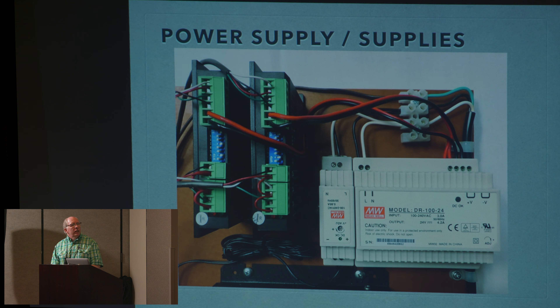At the AAW in Portland in June I did a talk on stepper motors, which motivated me to expand on that here and talk more about where they can be applied in ornamental turning. This is the apparatus — I've got it out on the table in there, you can see it or come ask questions. This is two of the industrial drivers to drive a slide rest and the spindle on that lathe. It's got two power supplies — here I've got a 5-volt supply on the left to talk to the brain and a 24-volt supply on the right, which gives the power and oomph to get the motors moving.